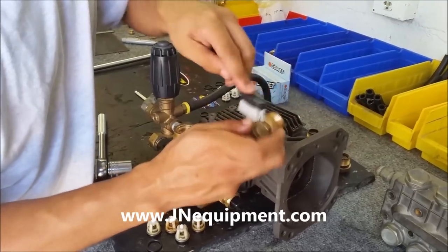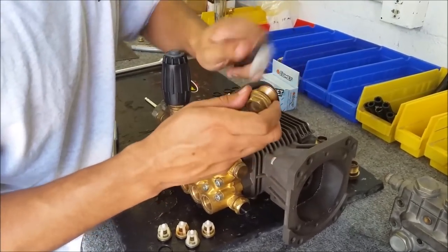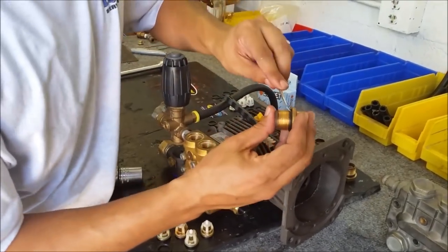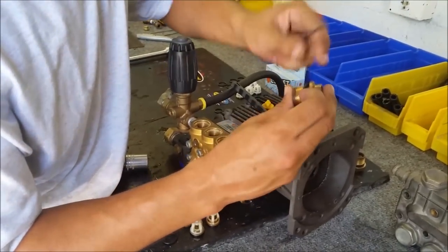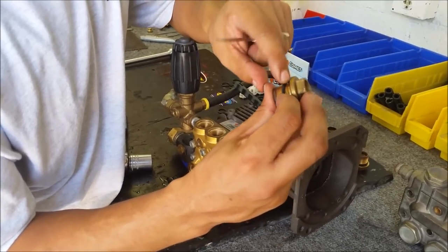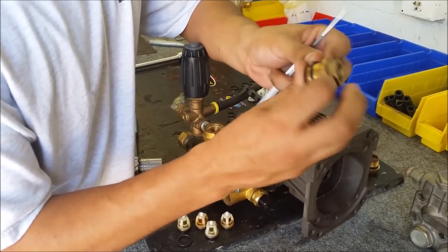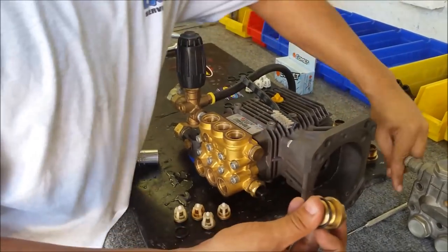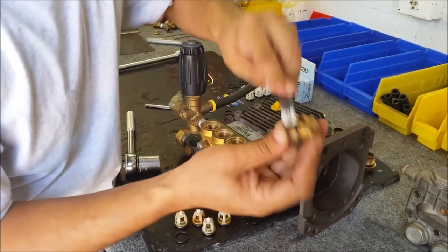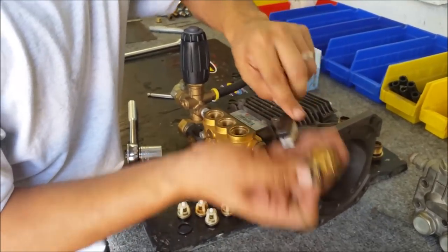Once again the brass is a really soft metal, so I don't use a metal brush. You could probably get away with it as long as you're gentle, but you see it cleaned up really nicely. There's actually a seat here where the O-ring sits, so it sits down inside that seat. I'm going to take a moment to clean that up also — in this example it was just a little bit of thread lock that they put in from the factory.